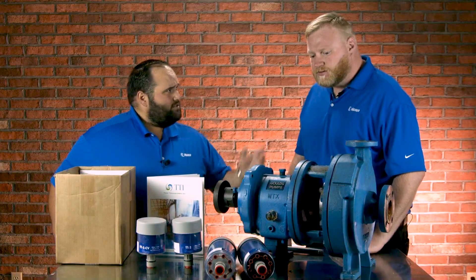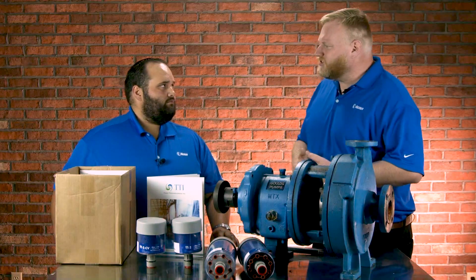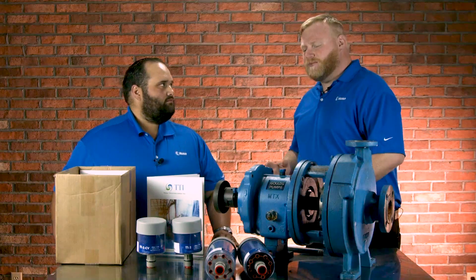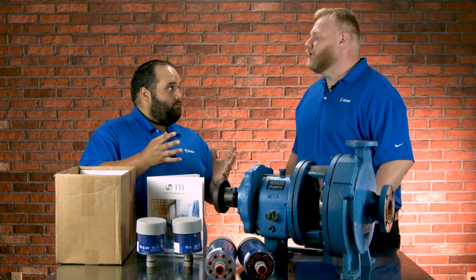With the check valves they have here, where would you typically see a check valve being used? With the CV application, we're going to utilize those in lower flow applications — think about a wet sump gearbox. Also areas where we may have high humidity, like power generation with a lot of steam, or food grade industry with wash downs and sanitation at end of shift. That's a great application for the CV or check valve. With the standard TT2 or TT4, those are typically utilized more in hydraulic systems, circulating systems, or bulk storage — something where oil level is going to fluctuate and breathe in and out. We want to make sure it doesn't restrict breathing as much. With the check valve, things stay sealed off better, not exposed to ambient conditions as much, so we'd expect to see extended life of the desiccant itself.